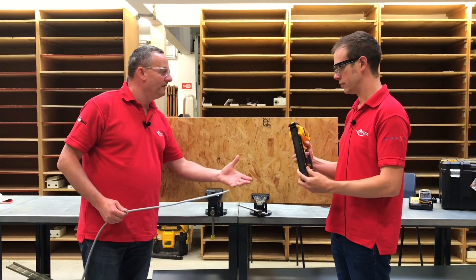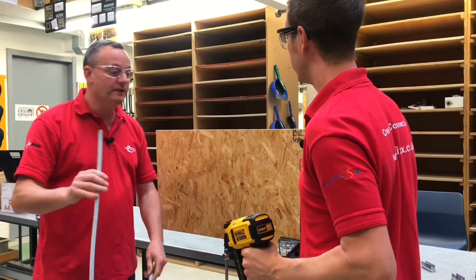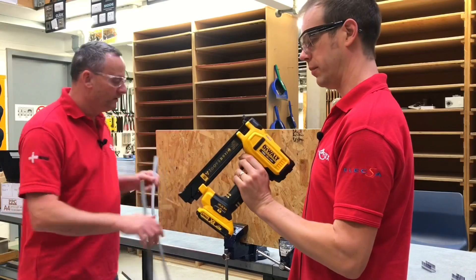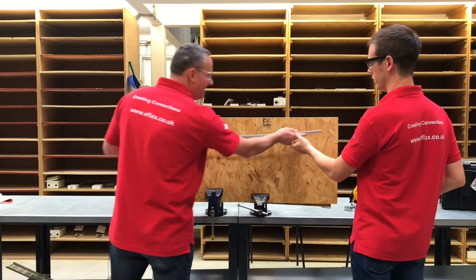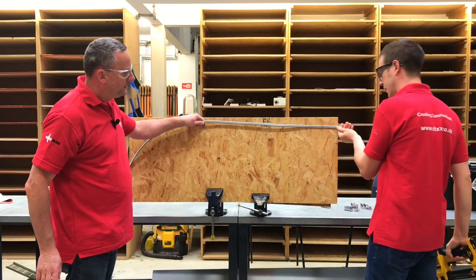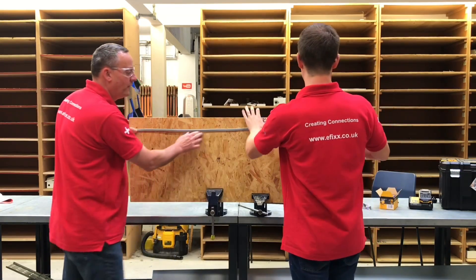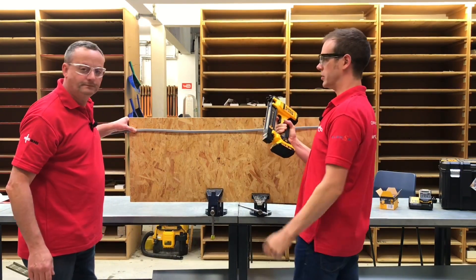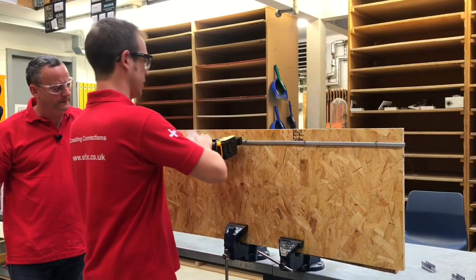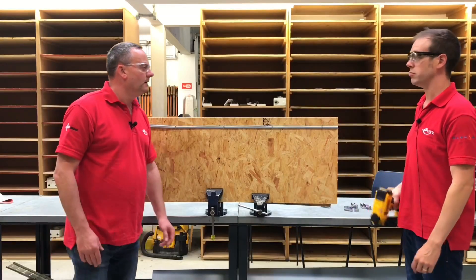First time for both of us stapling cables — let's have a go. We're going to use a 6mm cable because there's a 19mm wide space between the staple. A piece of 6mm is probably between the six and ten millimetre range — the largest domestic cables you're going to install. You fire one in — depress the actuator and it fires in, entering quite nicely. We're going to fire some clips in using the classic spacing distance of the length of the tool, and we get four supports in rapid time.